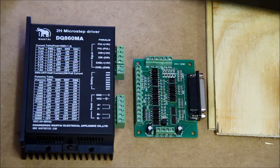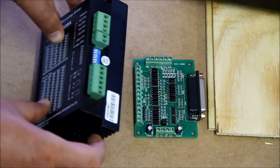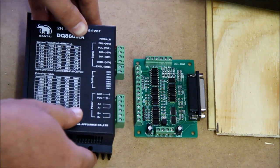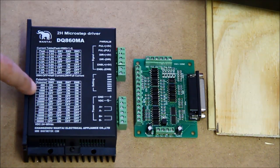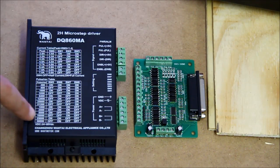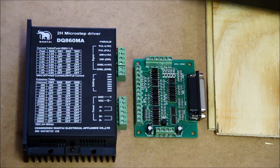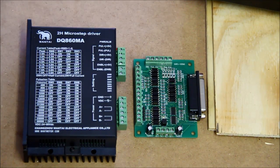Over here are the DIP switches. These are the same as the Gecko driver's resistor — they talk about how many amps you'll be putting into the motor. The other switches talk about the pulses you'll get off the motor depending on what type of motor you have and how many degrees it turns per step. You should get this information from whoever you bought the motor from — if not, send me the info and I can help.